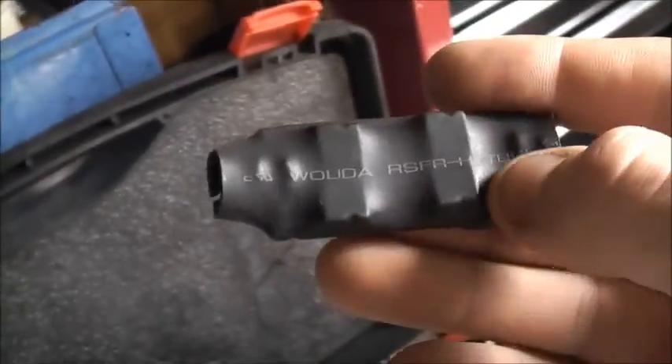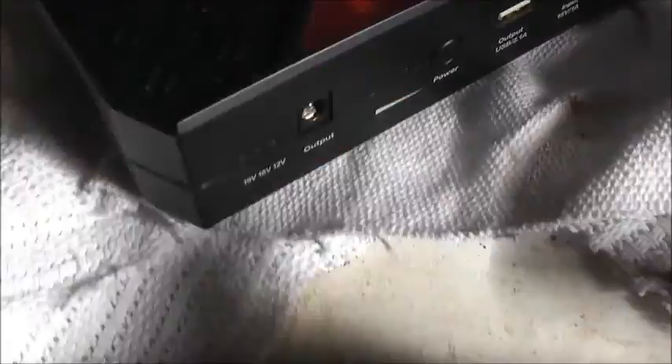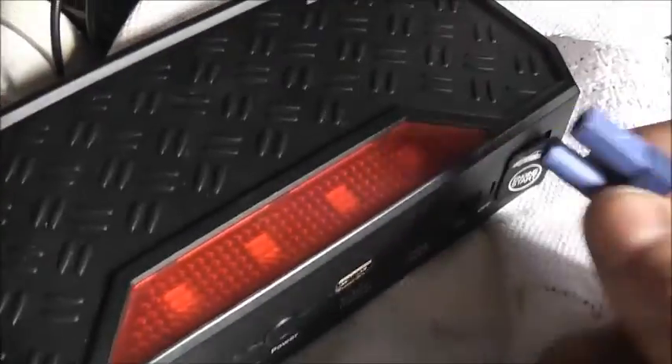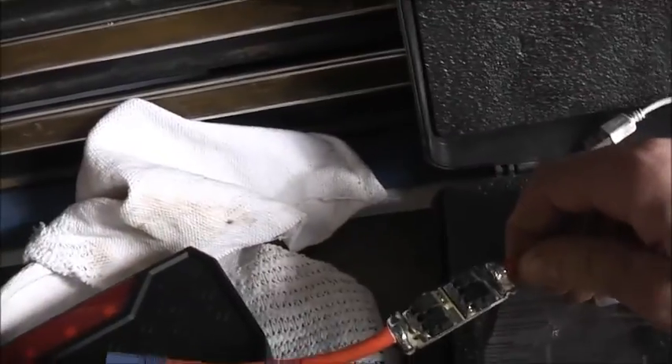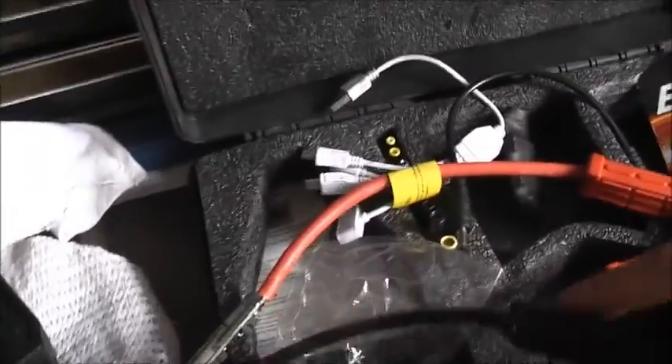When those are off I'll replace them. I haven't got the right heat shrink but I'll put some normal heat shrink and layer it over and over until it's thick enough. Make sure — my brother's friend's cousin did this — make sure he doesn't overload it and crank for too long. There's a lot of protection there for a reason — don't abuse them. Jump starters like this are only meant for a short burst to start a car if the battery is low. Not to start the car without a battery and crank it like a cold-start diesel. It's not designed for that — it's not something like a welder or to burn out a starter motor.